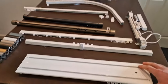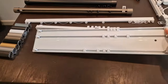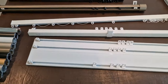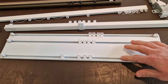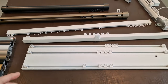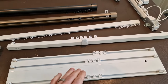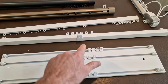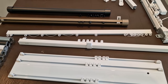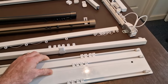The next product is our multi-channel track system — a really lovely product. What we all love about this is it's super low profile, less than a centimeter. Standard gliders in this example, but you can also have wave gliders. The distance from the front to the back channel is nine centimeters, so you could have an 80mm wave on the front and a voile curtain on the back — that gives you a double use for the rail. When you're working with three channels, you'd have to have standard gliders on all of them because the waves wouldn't have enough depth for the pleat to fold. You can have left or right control, and fixing is straight up into the ceiling — super low profile giving you that lovely generous wave effect.